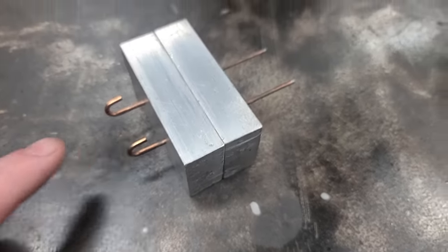So I took a piece of Scotch-Brite and I cleaned those holes out after I was done. Now these two holes are shaped like a drill bit. On this next hole, I'm going to use a round ball end mill. Now you can get round ball end mills on Amazon and online, and sometimes you can find a pretty good price on them. But if you get a good one, it's going to be kind of expensive. And I really want to see what the difference is in the looks of them. So this side's going to be the drill bit, and this other side is going to be drilled out with a round ball end mill.